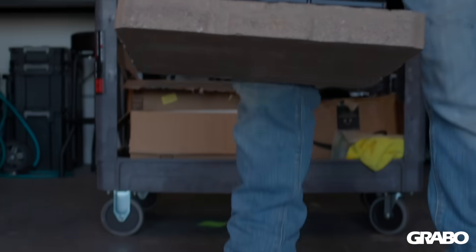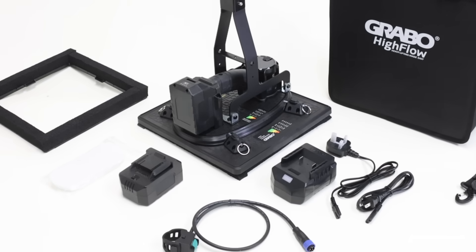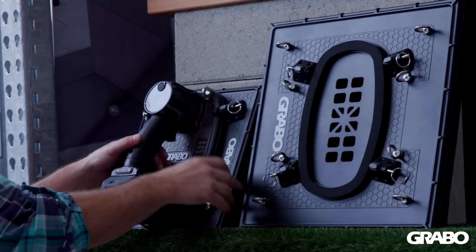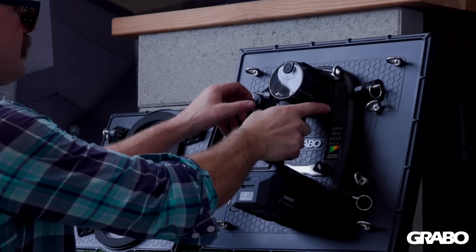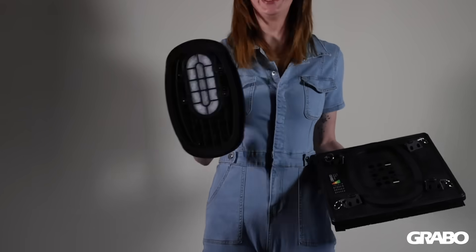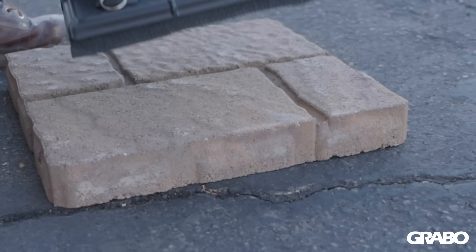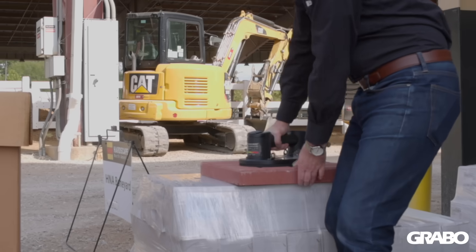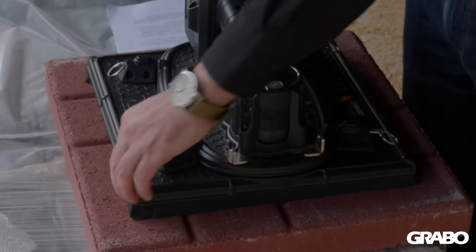The new Hi-Flow is packed with new features. Users will immediately notice the new bottom faceplate seal. The new faceplates come in multiple sizes and are interchangeable to suit your workload. With four quick lock pins, easily remove and lock in different sized gaskets for different lifting loads. Each faceplate features our new SmartCut foam, which gives users the ability to grip some of the most extremely textured materials out there. The foam can fit and form into grooves and textures our standard foam seal can't fit in, which opens up a new world of materials users can grip.